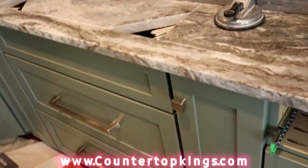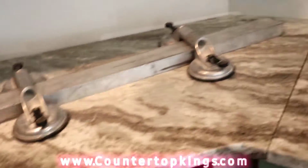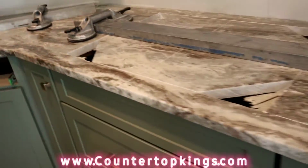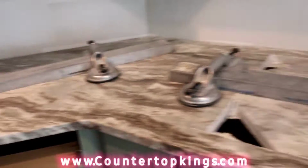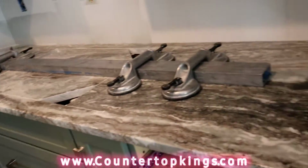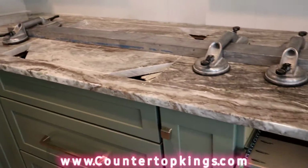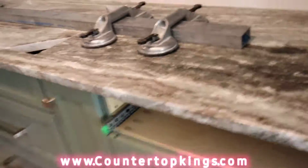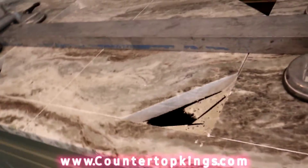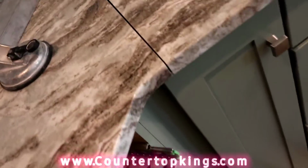It's just not right. I've worked for companies where they would take this area right here and they would put a seam in every one of the corners. Okay, so they make this three pieces instead of the two that I've made it. And what they can do is they can just line this up in a corner and maybe use a quarter of a slab. Okay, I had to cut into two different slabs. I had to have a brother, sister, I had to cut this one, then I had to find where this one started on the other slab and cut it so I have a perfect seam. Now I have remnants and I may have to sit on it a year before I sell the remnants and it'll be at a cheaper price. But, so what, I only make $800 profit instead of the $2,500 somebody else has made. I can sleep at night knowing that I did what was right and what was fair.